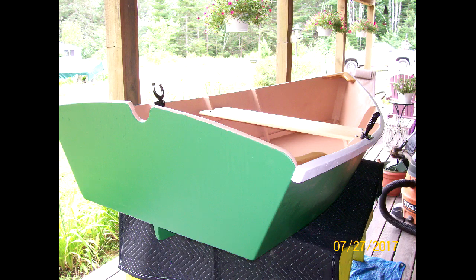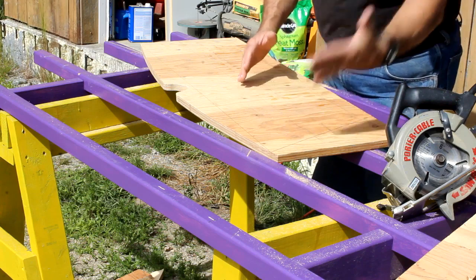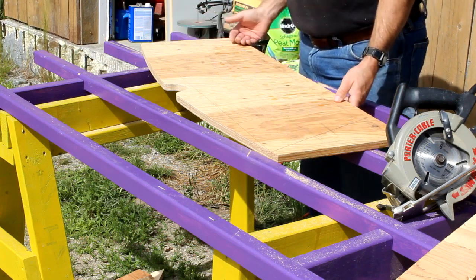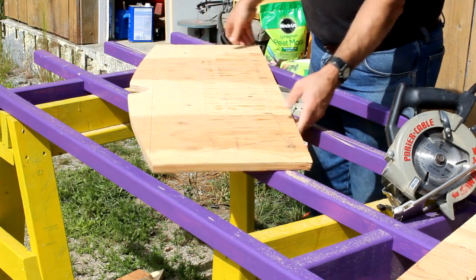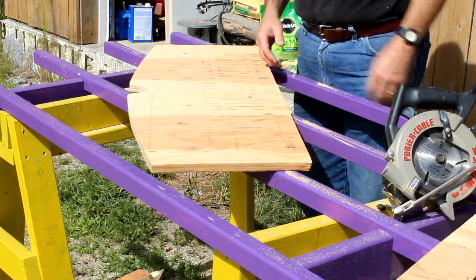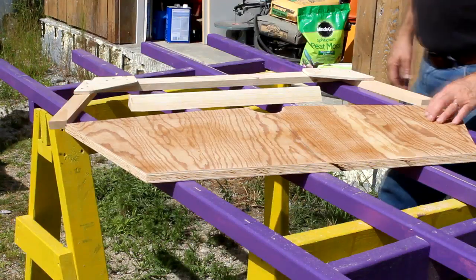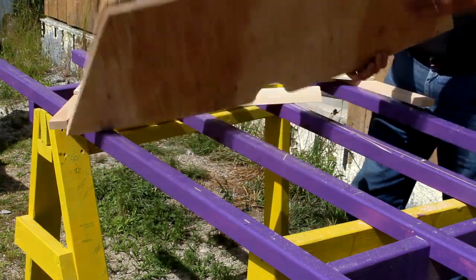Here's another shot of the finished boat. After making the stem and mainframe, I cut out the transom — in this case, just one piece of three-quarter-inch plywood. I had to cut the bevels along the side and on the bottom, which are given in the plans. Once that's done, you have all the basic components, and the only thing left is to cut out the side panels.